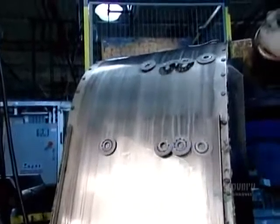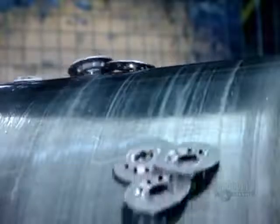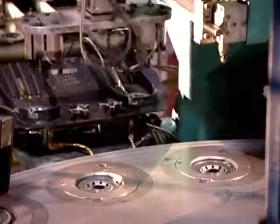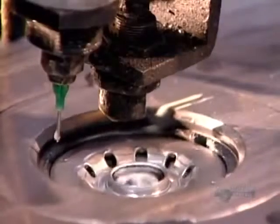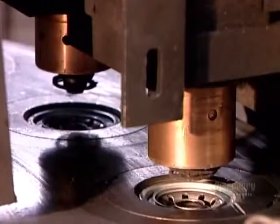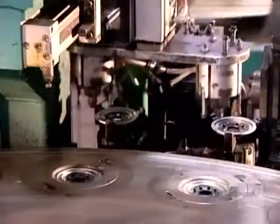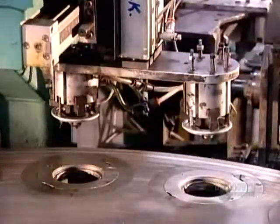Hot off the press, the tapping plates travel on a magnetic conveyor to the welding station, where a robotic arm loads them onto the welding carousel. Before any welding begins, a nozzle applies sealant around the rim of each plate to fill any gaps left between parts after welding. A robot then welds the tapping plate to another steel part called the bottom ring — which will hold the gasket, the rubber seal that prevents oil from leaking out as it travels through the filter into the engine.